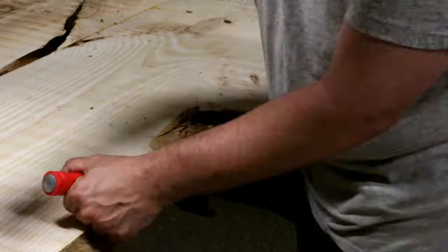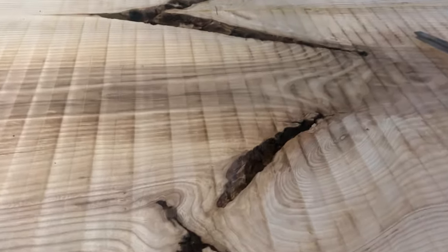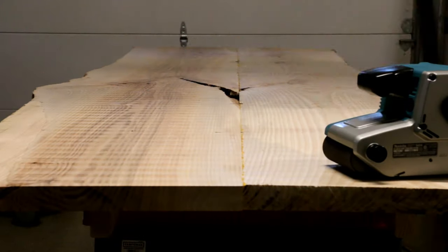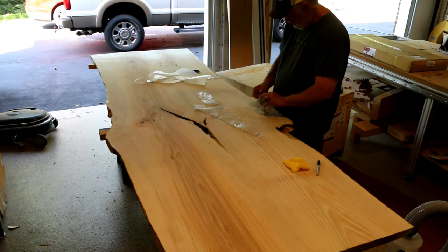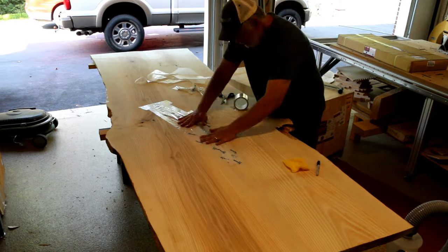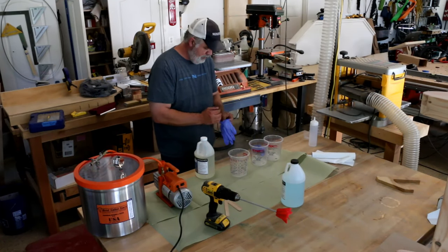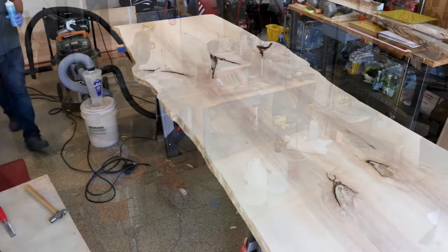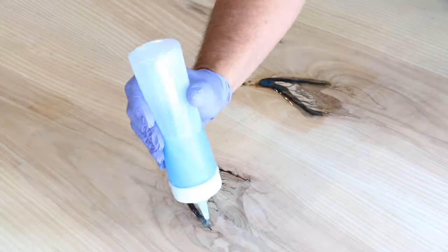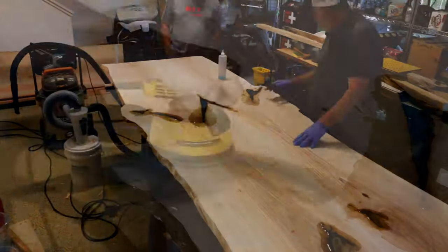Back to the top — I spent some time with a chisel, both removing bark from the edge and from the inclusions. I could have left the bark in the inclusions and it would have been fine, but I thought removing it would provide more depth with a transparent resin. There was a lot of sanding on this project — I would bet that I spent at least 20 hours of sanding. I used Tyvek tape to secure some polyethylene plastic to the bottom for the resin pour. The color choice of the resin was supposed to be a transparent blue, almost water-like color, and I think I was close. The first pour was a bit darker, providing a deeper blue bottom or base layer. The second was a bit more transparent to see some of that depth and the inclusions.